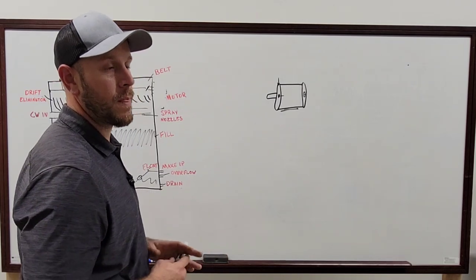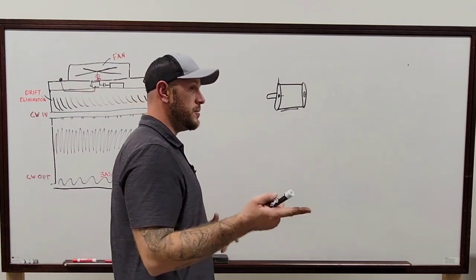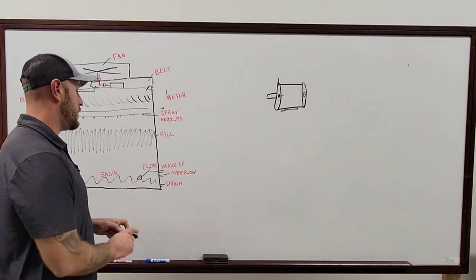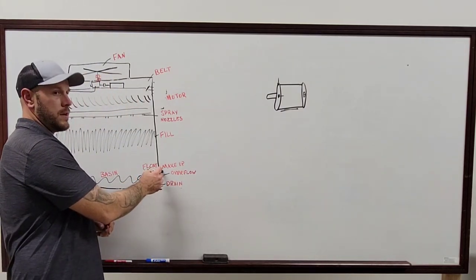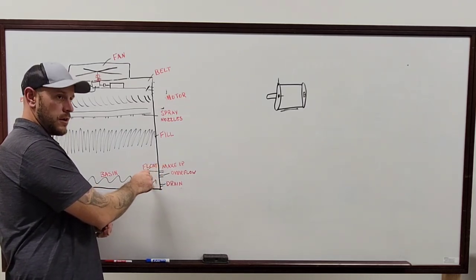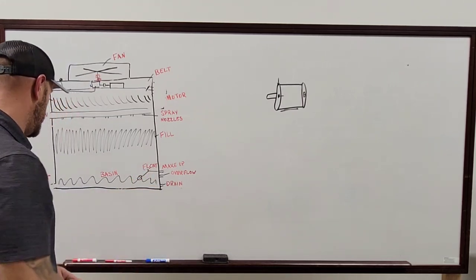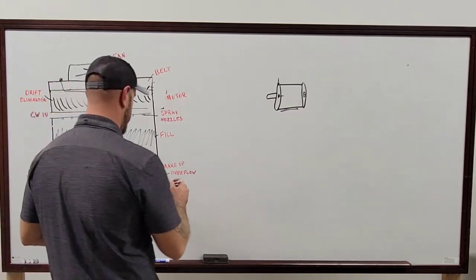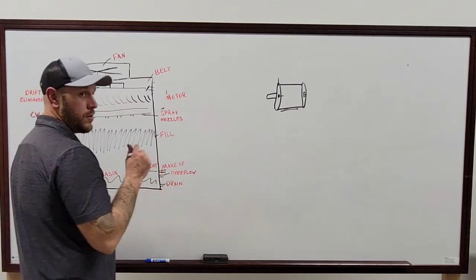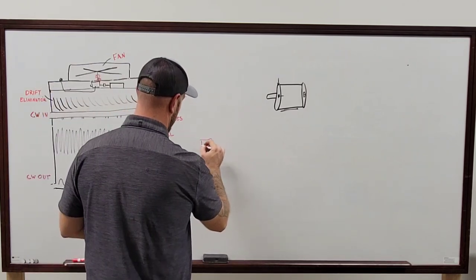I mean, you could go into how the electronic float switch actually works. Well, it depends on what kind of electronic float switch you're using, though. A lot of them, if you're using the electronic one, will have a solenoid mounted into the makeup water line. And all that's doing is there's a couple of sensors inside the tower that go into the water. I'm talking about the one with the rods. Okay, yeah. This is where your solenoid would go on the outside of the tower on the makeup line, which is then wired back into a control box somewhere out on the side of the tower.